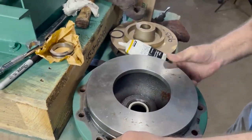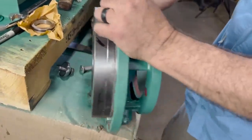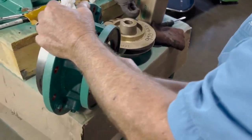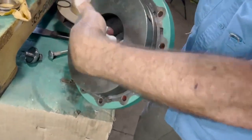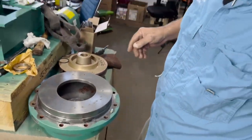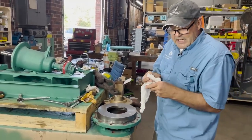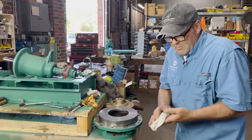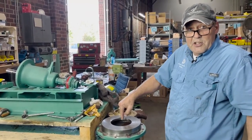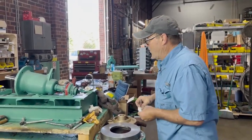Verify the stationary is very flat. Sometimes you'll need to stand it up on its end, look at it from the opposite side, and run a fingernail around to make sure it's flat all the way around. If this is not installed flat, your pump will leak when it's running but not when it's stationary. So if your pump is not leaking while in standby but starts leaking as soon as it runs, it's because that stationary is not flat — the seal can't make up for that difference as it runs.